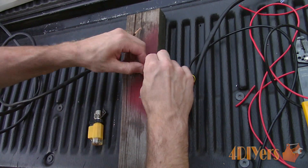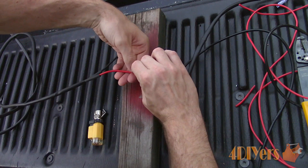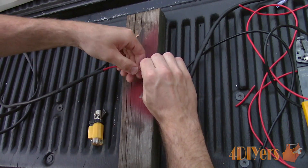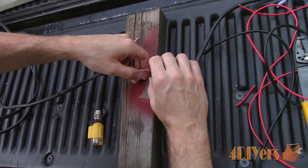When using one of these torches, we want to use the hottest part of the flame, which is the inner blue cone. The tip of the inner blue cone must touch the conductor when soldering, otherwise the connection may not heat up enough or may take far too long. If you go closer to the source of the flame, it's just like the outer flame layer — this isn't the hottest point.